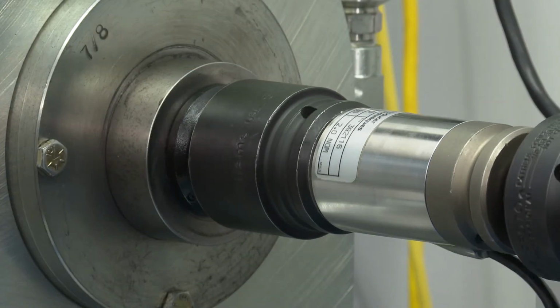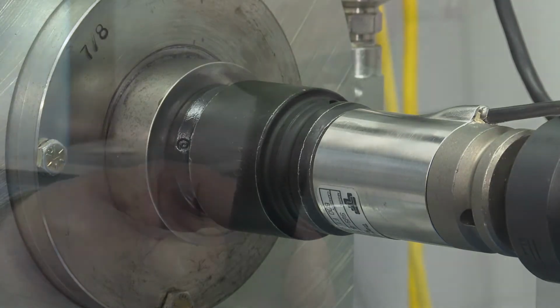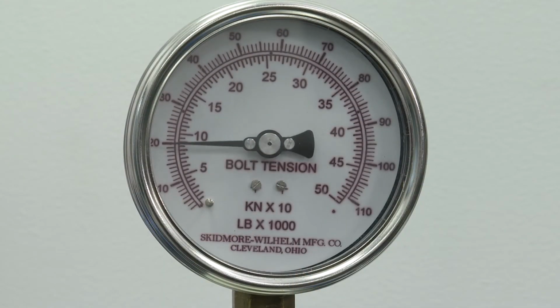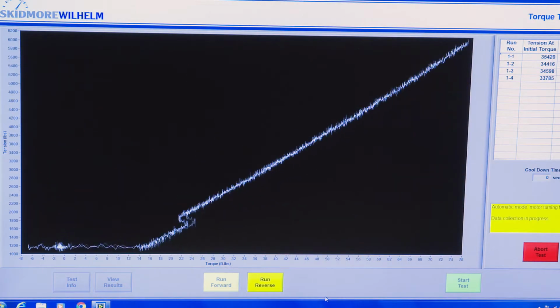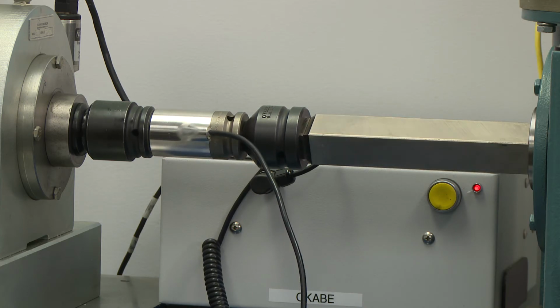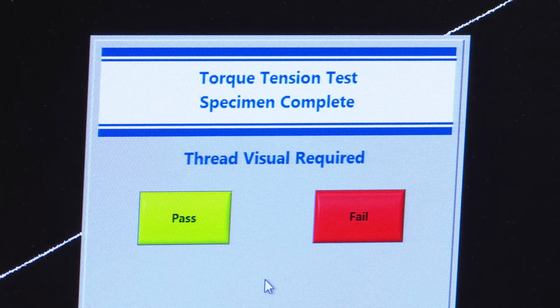Studs and nuts should not be re-lubricated at any time during each section of the 10 tests. New nuts and studs are used for each series of the tests. The nut assembly and stud must achieve the torque and tension specified in the SAE J1965 procedure. In addition, for each section of testing, a drop of 20% in tension between the first and the 10th torque at the final torque will also constitute a failure.